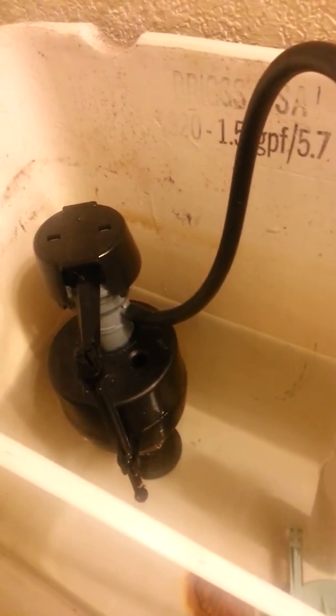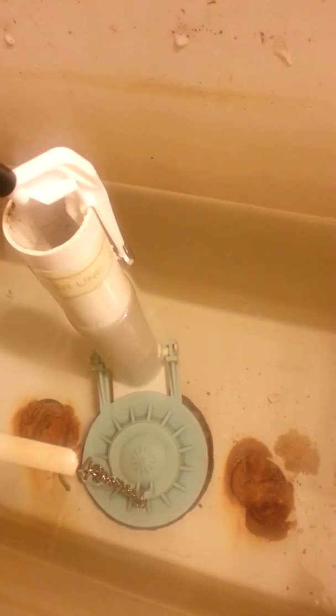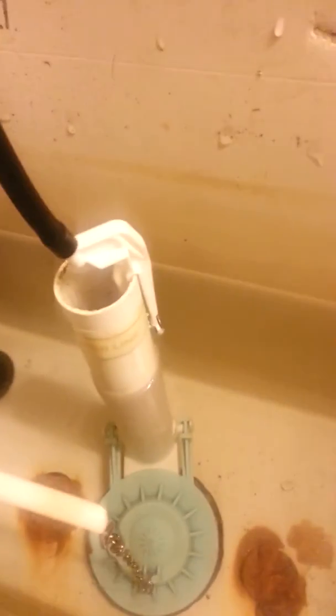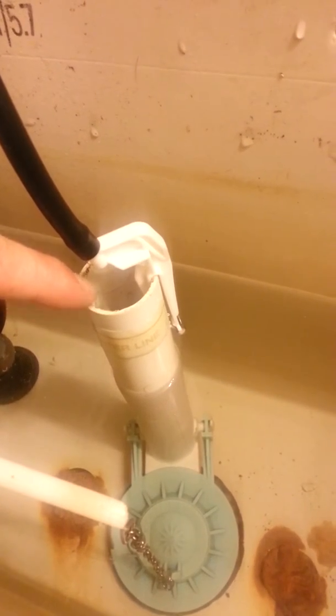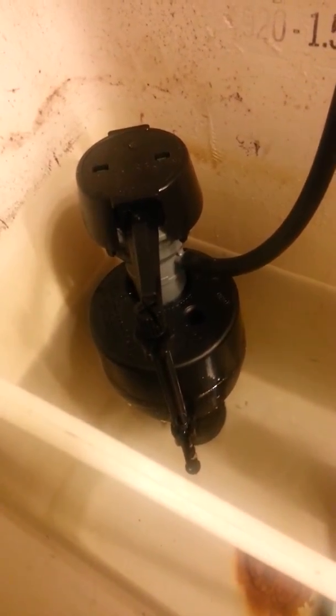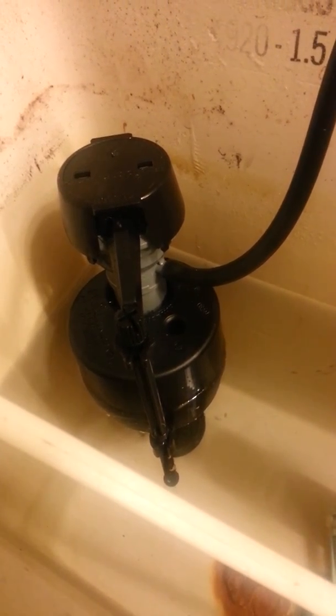Nine times out of ten, your water fill valve is going to be the last thing you want to look at. The very first thing you're going to want to look at when you have a running toilet is the flapper valve. You can take it apart, clean it up, put it back on — just take that and that off and it will come right out. Clean it off with a paper towel or a rag, put it back in, and drop some food coloring in and see if anything runs into the bowl. If not, your next step for a running toilet would be to make sure that your water level is not too high, because if water falls in here it's going to constantly be running into your toilet. And the last thing to check would be your water fill valve — if everything else checks out good, swap that out. They're pretty cheap, pretty easy to do as you can see, and it will solve your problem. Thanks for watching.